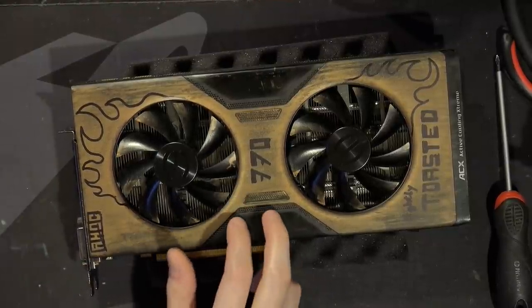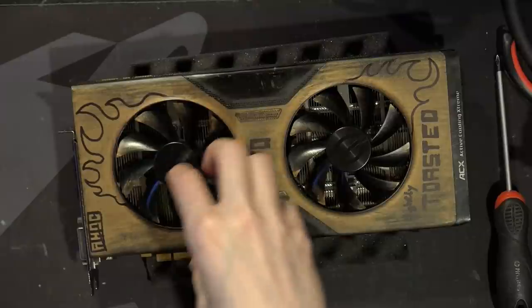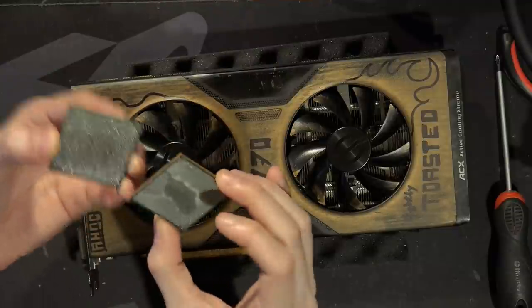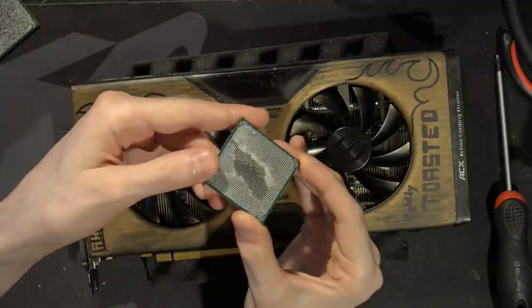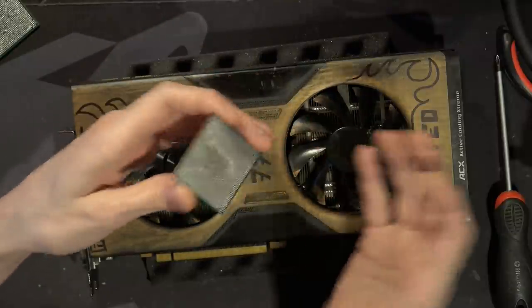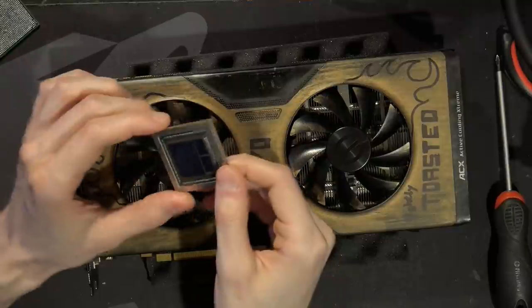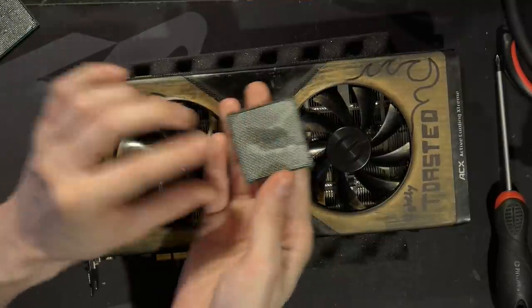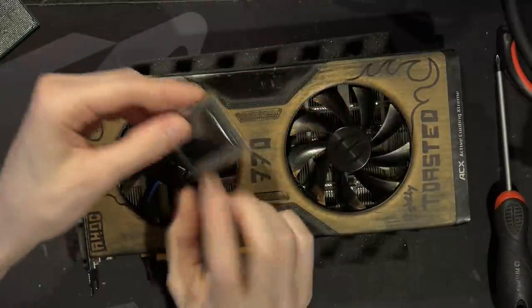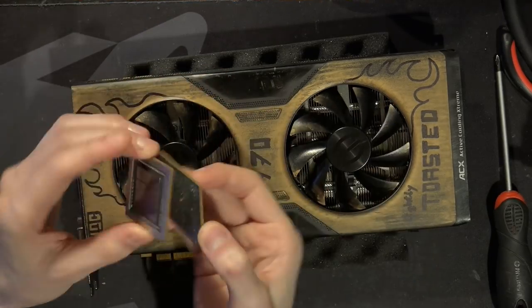With the PCB getting heated up by the toaster, I only need to heat up the core on the front a little bit, and that means I can get all of the solder balls to melt at the same time. This chip right here is the best pull I've ever done for a GPU core, because a lot of the early pulls I'd rip up memory traces and that kind of thing. This one is really clean — except for the part where the chip is dead — so I'm really happy with that one.